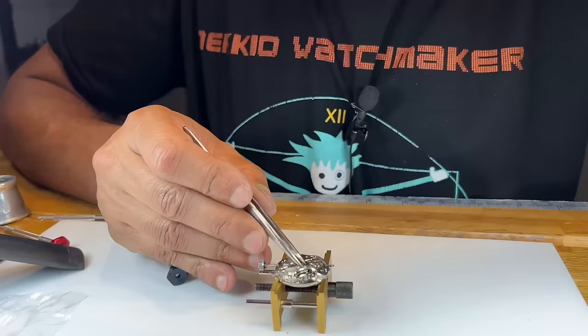So most of the smaller ones are gone, and we've just got a couple of big ones here. Very gently, as we don't want to burn the plastic with too much heat and the friction. I'm doing it in circular motions just to keep it all even and not have any flat spots. Even though some of the areas like this don't need any material removing, it's best to do all of it so we get to the level of that scratch, so we have an even surface all the way around. So we just keep going in circular motion.